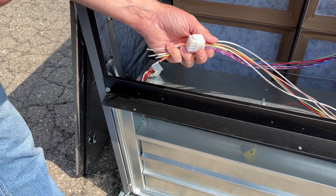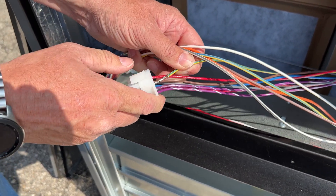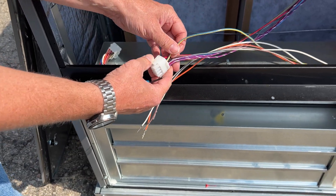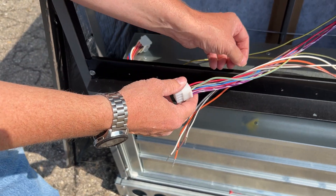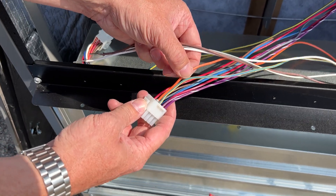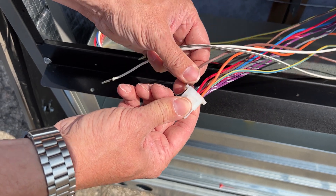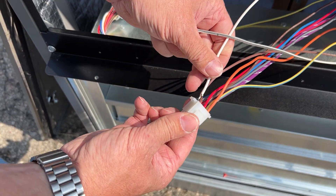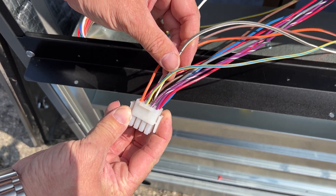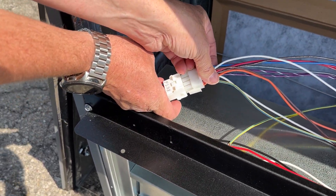You need to use a pin tool to remove the yellow and blue wire from the Molex and replace that with yellow and blue wire from the new harness. The wires will line up accordingly on the mating plug, but orange goes in, then brown white, white with a black tracer, and we'll plug that in to the PL38 plug.